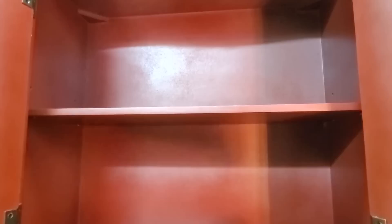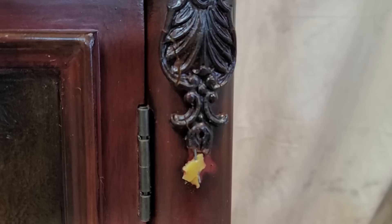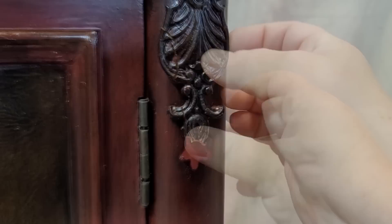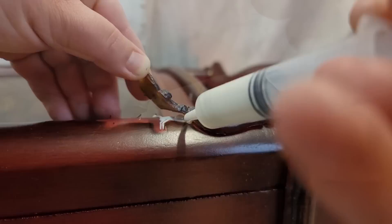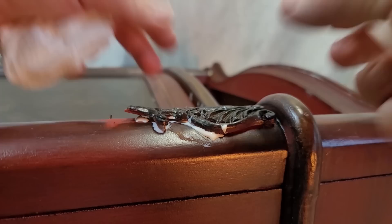This cabinet has a shelf that is screwed in, so I'm going to remove that first before moving on to repairs. Now let's fix this damaged applique — I'm using my dikes to cut off the hanging part, which does end up damaging it a little more, but I can fix that. I laid the cabinet on its back, grabbed a glue syringe, put some wood glue underneath, taped it down, and let that dry. These glue syringes were sent to me off my Amazon wish list from Reconstructing Emily — go like and subscribe to her channel!